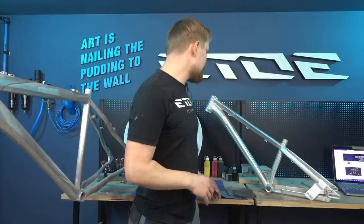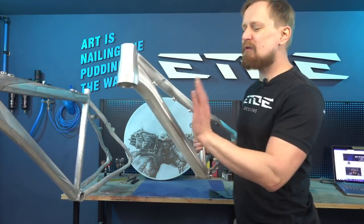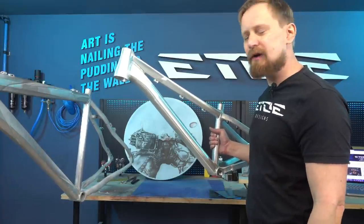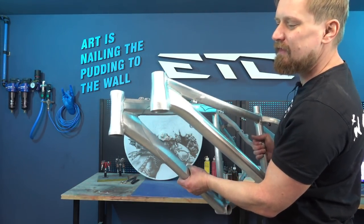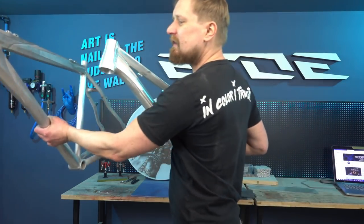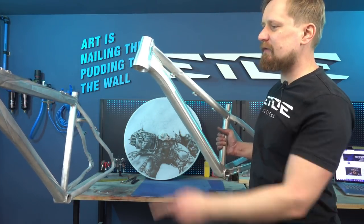The monster paint job is lost, so maybe you have a cool idea for this frame. If you want to achieve brushed aluminum, I can recommend buying a high quality frame like this one — it's still brushed, but I can't paint it because it's a client frame. You can see the difference: check how much lighter this one is compared to the dark aluminum of the cheap frame. That's nearly white compared to the other one — it's all about the alloying. This frame is possible to brush and polish. That one is not.